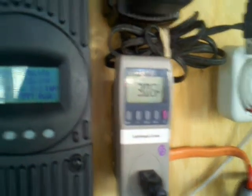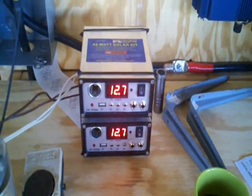We are making 300 watts, and we're using just over 300 watts. We dropped to 290. Battery voltage is holding at 12.7. We're pumping 22 amps into the batteries through these charge controllers. This charge controller still hasn't kicked on yet — the cooling fan hasn't either.